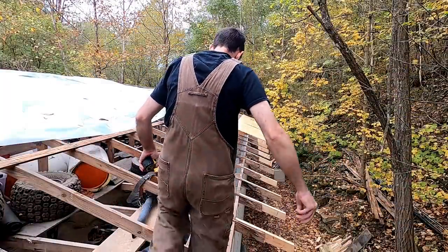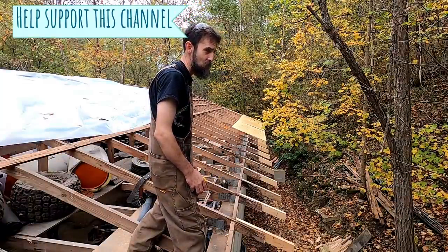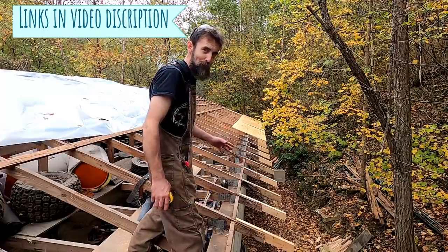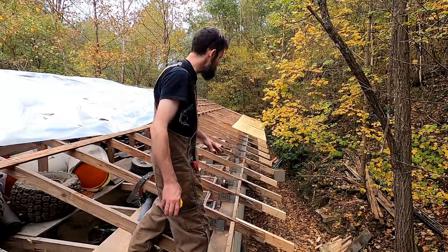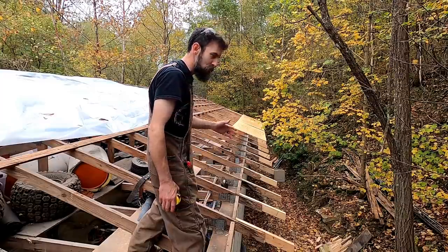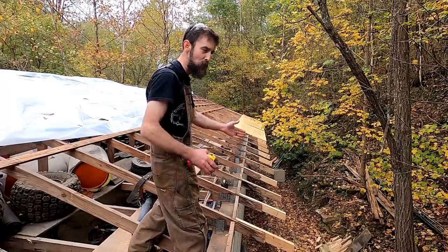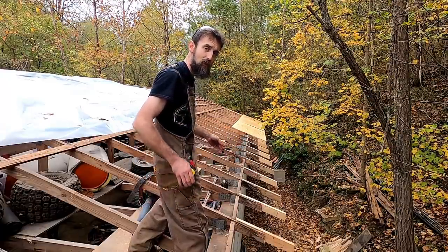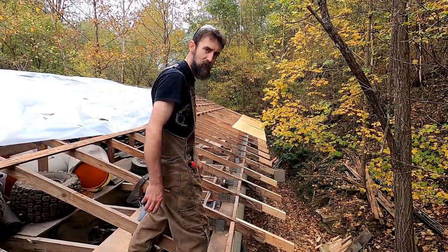Well, I've got a major problem. Now, I've laid a few sheets up here and it quickly became evident what the problem is. They don't have their truss layout right. There's lots of reasons why they did it wrong, and we could go into that, but your trusses should be on 2-foot centers. If you're setting plywood, the end of your plywood needs to end on the center of one of these trusses. That way you can start back off with your next piece of ply, and your ends have somewhere to nail to.